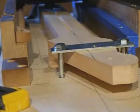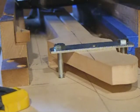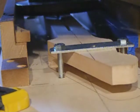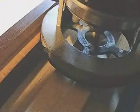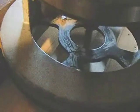Here we have a lengthwise shot from the headstock to heel. What I usually try to do is just one pass — I don't like coming back over what I've just done in case something goes wrong and I wreck the route. I'm using an older router so when I come to the end I just let it wind down. I'm doing this by myself, holding the router with my right hand and the camera with my left, taking my time and making sure the depth isn't too deep so I have a little more control.